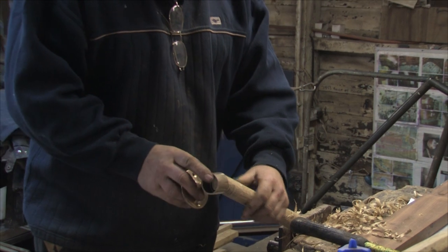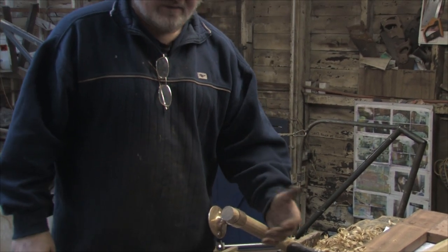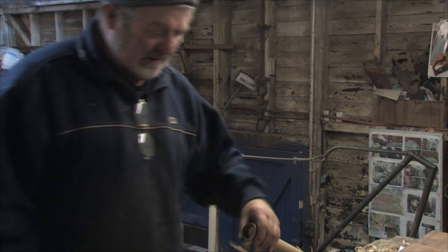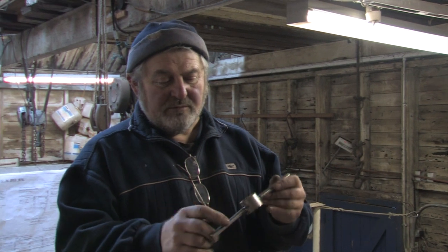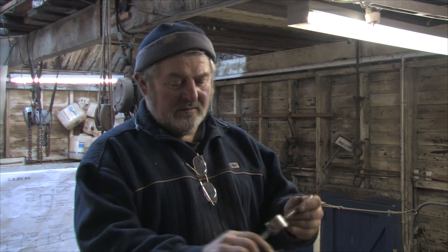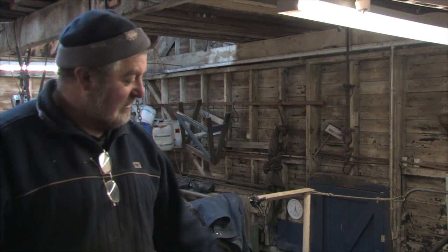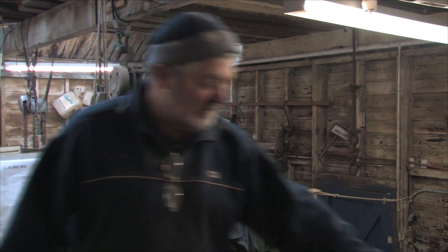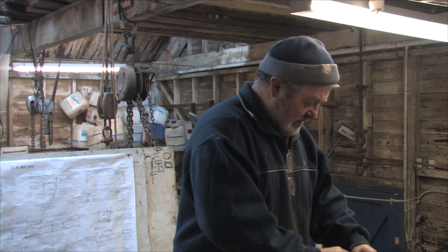Makes it nice and round, and that's the right size for our fittings. So that's just a little tip if you want to get something nice and round. Piece of pipe with a weld on, couple of handles to help you get it round, and that'll be run full length on the job. Then the handrails will be fitted onto the ends, and everything's going to go nicely onto the deck.